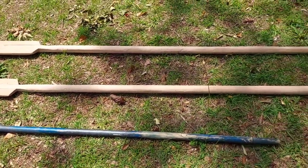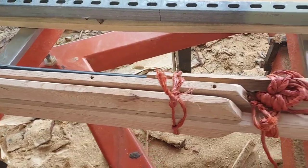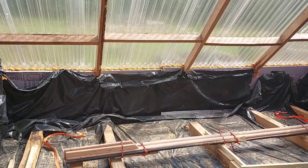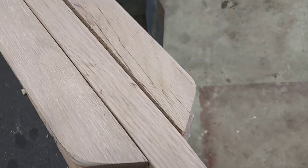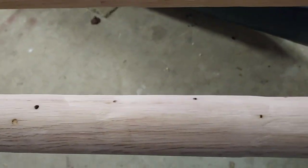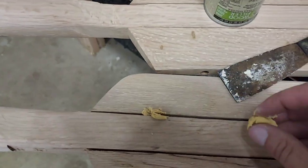This is more or less what I ended up with. At this point I realized the project probably wasn't going to work because they were so heavy. But I was told they would lighten up when they had a chance to dry — this was some green wood, still had a lot of moisture in it. So we strapped it to a metal beam to prevent warpage and put it in a kiln, so it got really hot and spent a month in there. When I got it out, it actually looked nice and dry. Some of the screws needed to be tightened a bit more — I guess the wood had shrunk a bit. There were some bug holes that became more apparent after it dried. But the oars were much, much lighter after coming out of the kiln, so I got more hopeful.